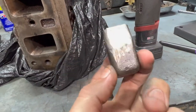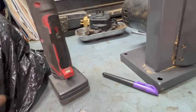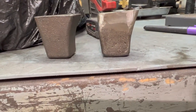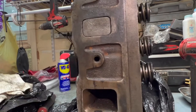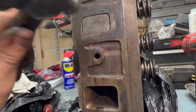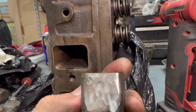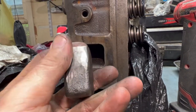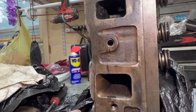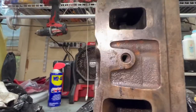Probably about 30 minutes later - this is kind of what we have. Even though this sanding disc is worn out it works well; it's kind of a before and after. It's just really forming the curve and I really thought I could get this thing to press in, but this cast iron is just not budging. I got a little bit of lip right here, so I've been tapping it in. You can see where it's hitting - those little chips - it's not hitting anywhere else. I kind of want it flush without hitting, because this cast iron is not giving. There's no press fit going on here; it's not really what I wanted, but it is what it is.